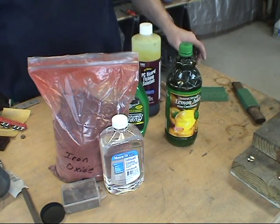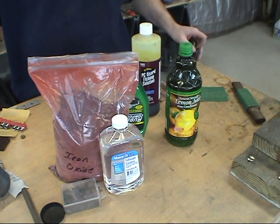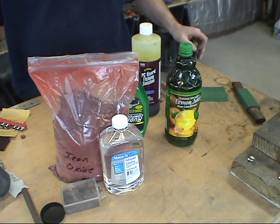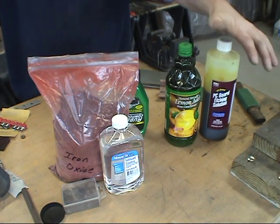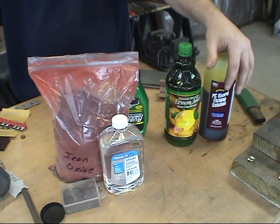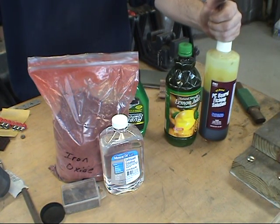Experiment — that's what I had to do. When you heat an acid, it has a tendency to function faster. If anybody remembers their chemistry: hot acids, hot metals — an acid actually multiplies in its destructive nature. I prefer to use the ferric chloride; I dip into it depending on how strong I want the demarcation. If I'm starting at 800 grit and dipping, I do quick dips for about 30 seconds into the ferric chloride.